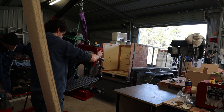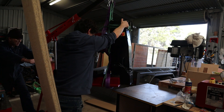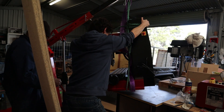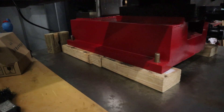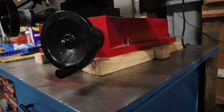When we got it over to the bench we saw that the crane wouldn't lift it high enough to get onto the table, so we had to lower it and shorten the chain so it would reach. We also put the mill on some blocks because we noticed the hand crank for the head was really close to the bench top — lifting it up just gave us a little bit more room.